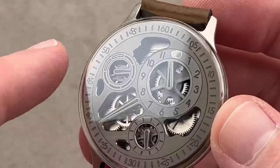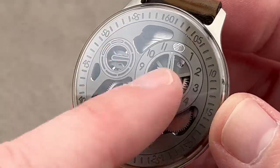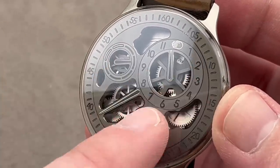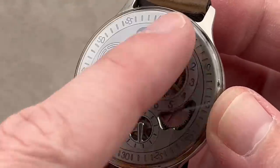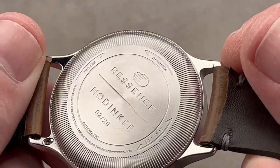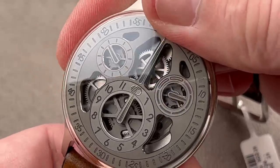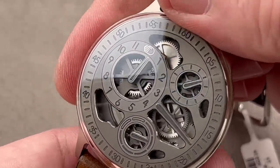The dial is made of German silver with a nickel anthracite coating. The movement total is 40 jewels — the ETA 2824 base only has 25, but with over 100 parts and 15 additional jewels, this Ressence orbital convex system dial module is very much a second movement atop the movement. This is Ressence's watchmaking contribution to the project. Crownless — it is set and, if you wish, wound using the case back, though it is an automatic winder.